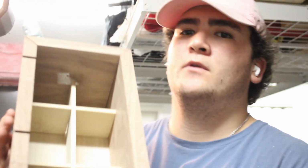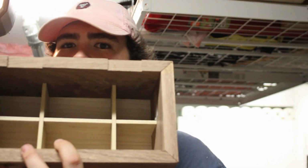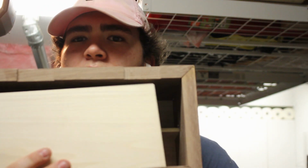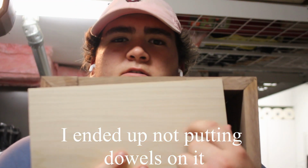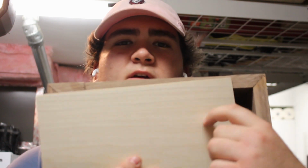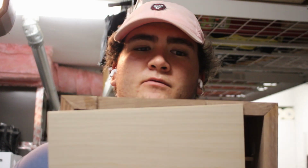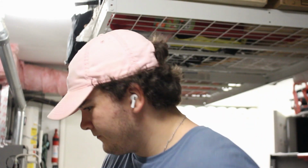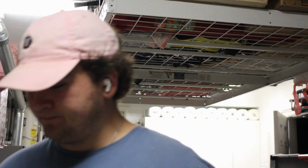It's looking pretty good. What I'm planning to do is have this go on top of it, and put one dowel on each side to be able to pick this panel up, but also to have as a ring holder. And then I'll just divide it in half with one divider. So I disassembled the whole box. Now I'm going to sand everything down with 220 grit, and then it's probably ready for assembly, and then a coat of Danish oil.